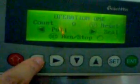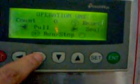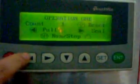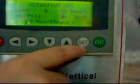Pull. You press this key one time, and the machine will pull the bag one time. And you press this key one time, and the machine will seal one time. In general, these two keys are used to adjust the machine. And press the set, and the machine will work automatically. And if you want the machine to stop, press it again.